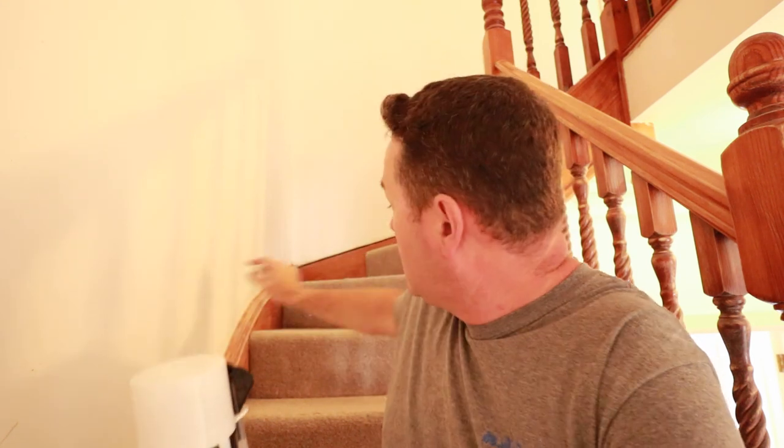What I'm going to do is give you a longer term fix, and it involves — like you saw at the beginning — silly foam. It's expandable foam, you know what you put around pipes and things like that. What I'm going to do is where I've got the wall — it's plasterboard on brick breeze block, you can hear it hollow — so I'm going to get a screwdriver or a drill, poke a hole in it, then squirt some of this in. This expands to easily twice its size, so if you expand it into the wall you'll stop that flex on that plasterboard.